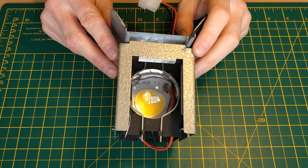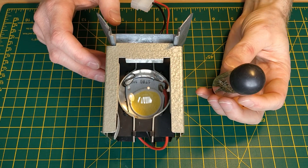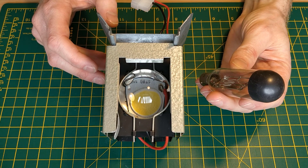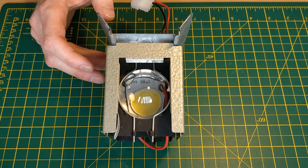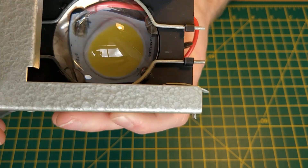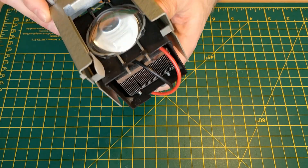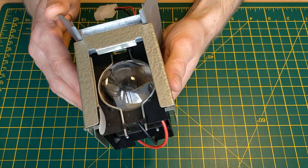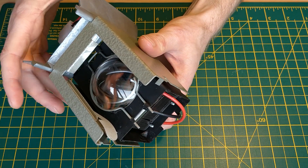Let's start with the LED module. Originally, the projector contained a 300-watt incandescent bulb. It was pretty bright, but unfortunately it was definitely the wrong colour temperature, and it also got very, very hot. It needed a very noisy AC fan below it to keep everything cool. So I had to remove this and the fan in order to fit the rest of the electronics into the enclosure. I replaced it with a 30-watt LED from LumiLeds. If you look into the lens you can see it just there. This has a colour temperature of 5700K. I went for this particular LED because it has a very high overall brightness — 4,500 lumens — but it's also got very high efficiency, about 145 lumens per watt.